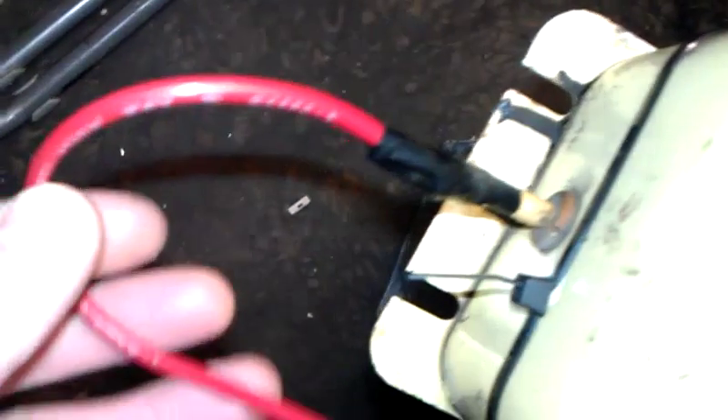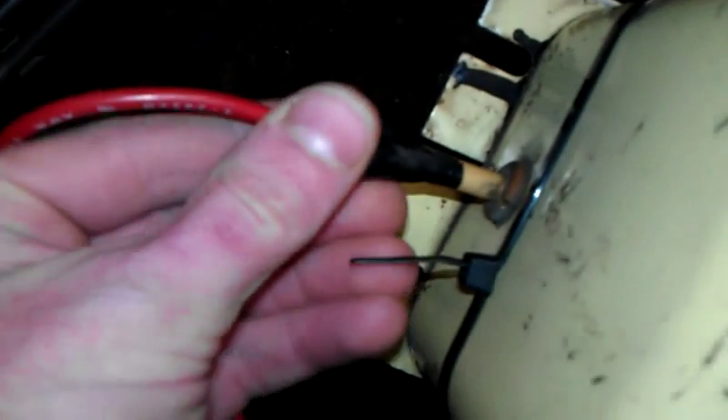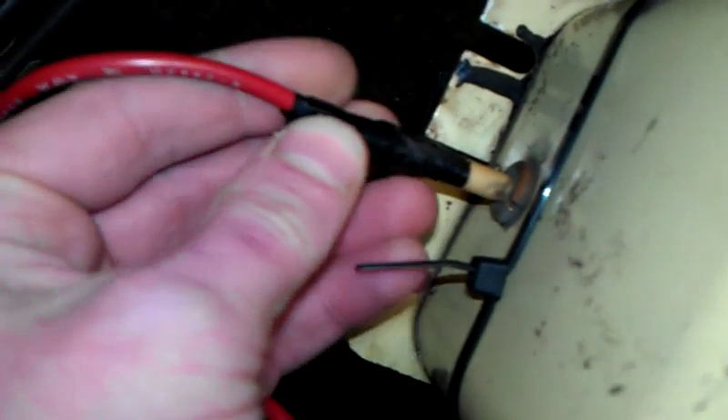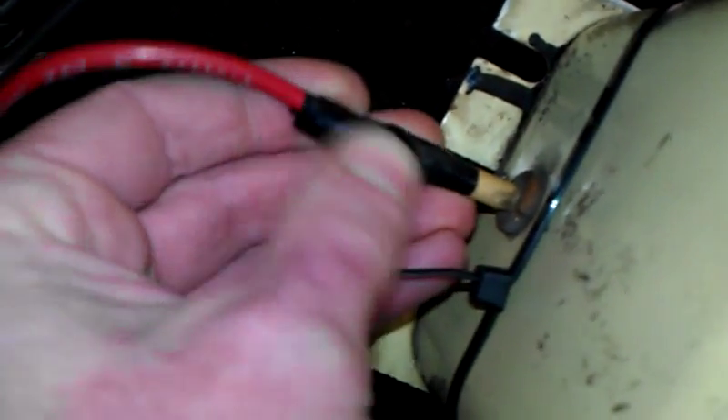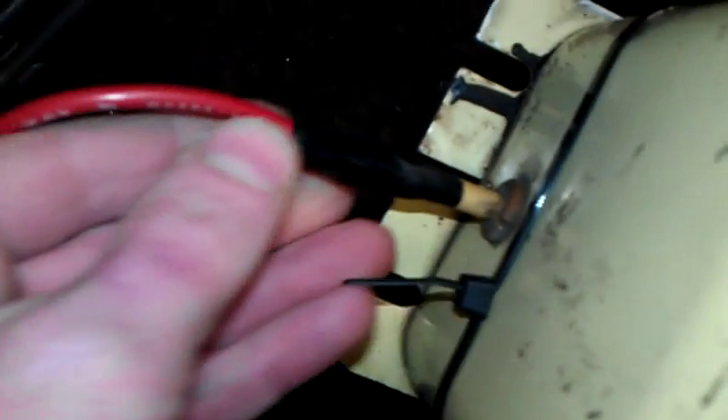This is the output — this is the best way I could do it. I've connected this 40 kV high voltage wire, connected it all up, soldered it, hot glued the crap out of it, and then wound it and completely covered it in insulation tape. I've done that to both sides.